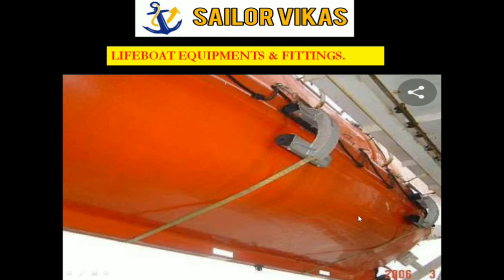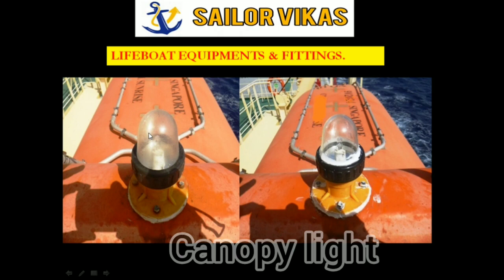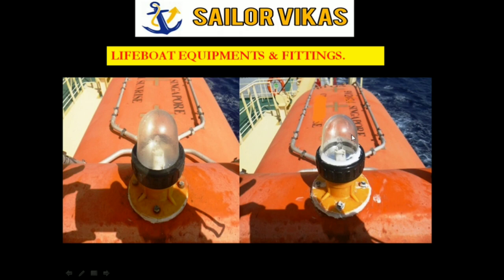Similarly, this fitting also comes under the lifeboat. This is the canopy light, which you can see here. You can see that in this light there is moisture accumulation. After the renewal of the light, this is the new light. Inspection is to be done to find things like these, for which PSC can detain your ship. So always make sure that you inspect and rectify these things well in time. This is why we do the inspection, to rectify this and take corrective actions.